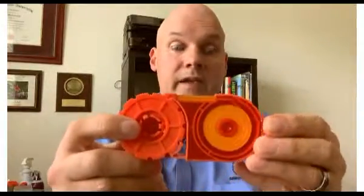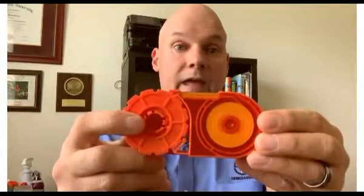The nice thing about our Smart Cleaner Cassette is it's smaller, so it fits very well into my hand. If you notice, it doesn't have a shutter system. Remember, the shutter only covers up the used material. So the nice thing about this is I can clean my connectors and decide when it's time to advance the ribbon. It's also very easy to see how much cleaning strand I have left — other ones have just a tiny slot in the housing.